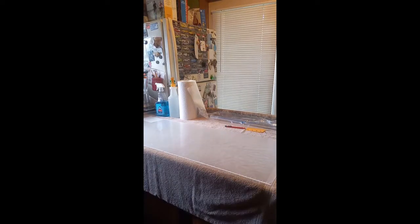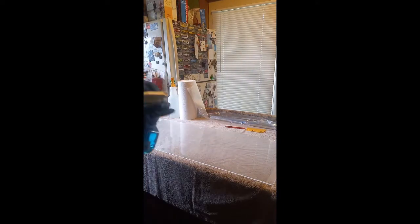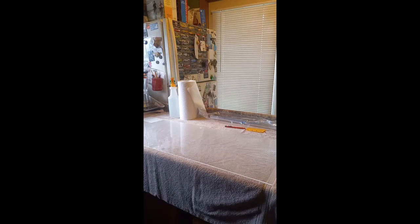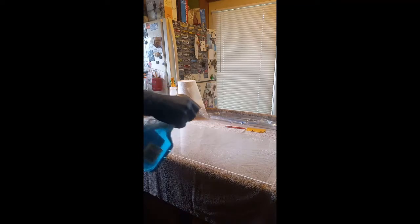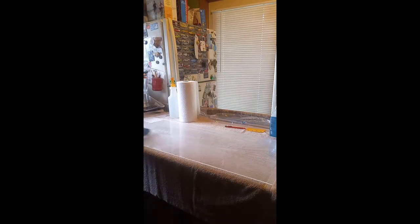All right, let's get these gloves on. This plexiglass has plastic film on both sides of it. You want to take the side that you're going to be putting your mirrored film down on, and you're going to want to peel it off. Once you do that, stuff's going to be kind of staticky probably. So that's why you want to hit it with the window cleaner, and spray instead of jet. One, it'll get rid of all the static, so you get rid of any dust or anything else. My wife happens to have four long-haired cats, so I want to keep everything off of this that I can. Give it the best result possible. But clean your glass up.